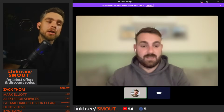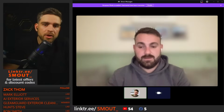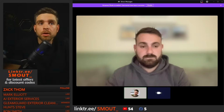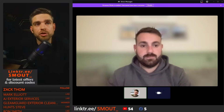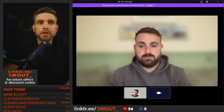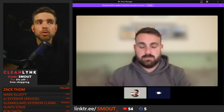Yeah, stay clear. I totally agree with what you said before as well about the best way to clean a driveway and get long-lasting results is to either pre-treat the whole driveway really well with weed killer yourself, or have the customer do it, and kill them all first, because all you're doing when you're pressure washing is chopping the heads off. They're going to be back in no time. So if you can get the customer to kill the weeds first, you're on to a winner, and you're going to get much more long-lasting results.